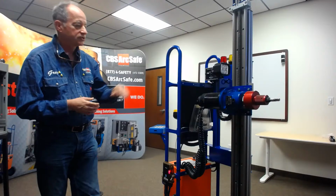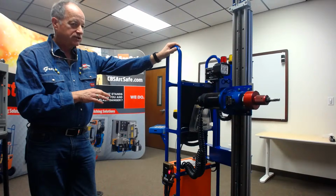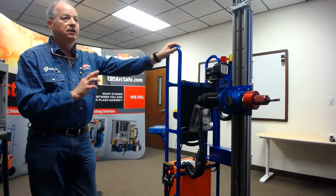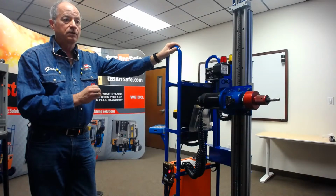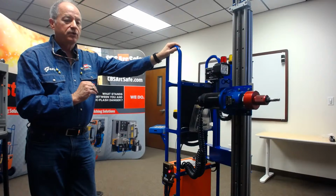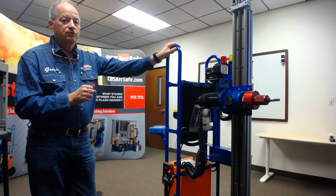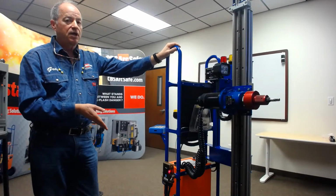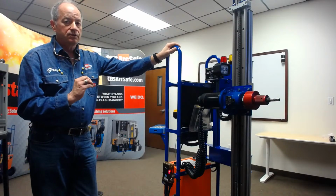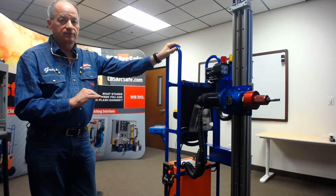Hypothetical situation. Okay, here we go. The first thing is it's a good question. The CCM has an indication on it for low battery. If you get down to low battery, you're down to 1 operation with it unplugged and just on the battery. The system is meant to be operated whether you can operate it plugged in or standalone on the batteries. If we're operating on battery and we're dealing with draw out breakers and you've got a new or well-charged set of batteries in there, you should be able to do 50 operations on a single battery charge. You can leave the unit plugged in 6 months to a year because it's got a smart logic charger on it. So it'll go standard charge or high charge, standard charge, trickle charge, and just be there, keeping everything charged and ready to be used.